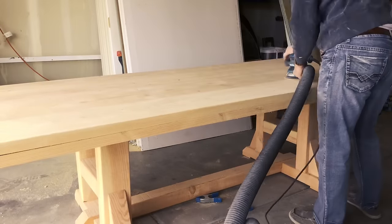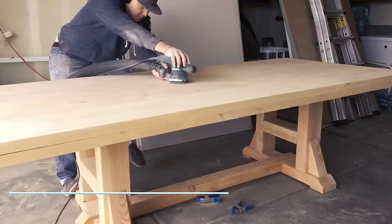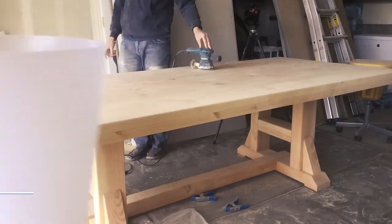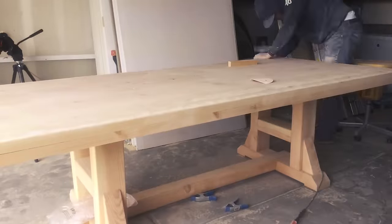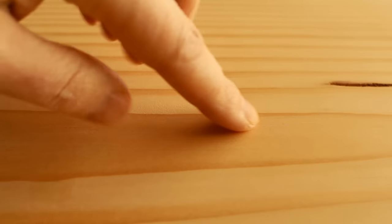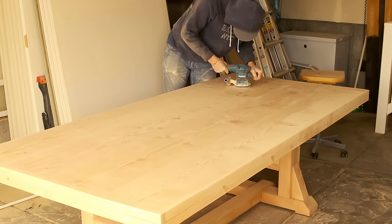With the skirts and end caps in place, it is time to sand. At this point you sand and you sand and you sand some more. I ran some 36 and 60 grit through the belt sander to do most of the heavy shaping, and then used the orbital sander to go through 80, 120, and 220 grits in succession. Before you call the sanding good, make sure you take a really close look and check for any scratches — this is the result of using the belt sander with 36 and 60 grit and leaving heavy scratches that I neglected to get out with the higher grits. You can use 120 or 220 grit on the orbital sander to take care of these. Check the rest of the table and make sure you're nice and smooth and ready to go.